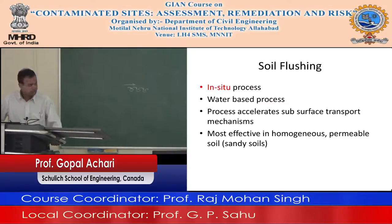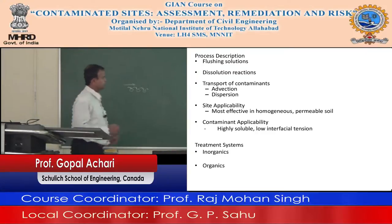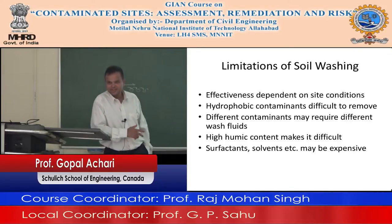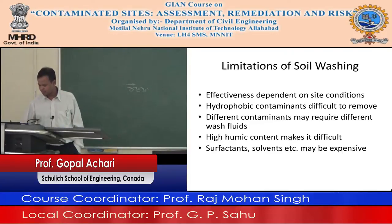There is something known as unconventional soil washing: water flooding and pressure application, enhanced oil recovery and surfactant applications are again some of the unconventional soil washing. So limitations of soil washing, its effectiveness will depend on site conditions. Remember, this is soil washing, the ex situ version, okay? Hydrophobic contaminants are difficult to remove. Something which is stuck, you will need more than just water, maybe surfactants and others as well. Different contaminants may require different wash fluid. That's a problem. It might require sequential washing. If you have soil with a lot of humic materials, natural organic matter, it makes it very difficult. And the cost of surfactants, solvents may be expensive.